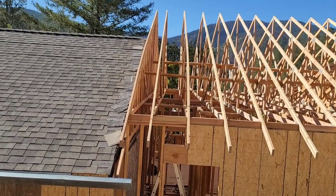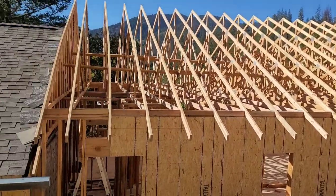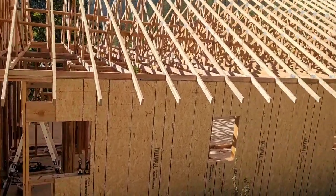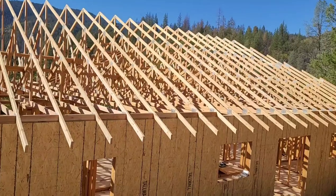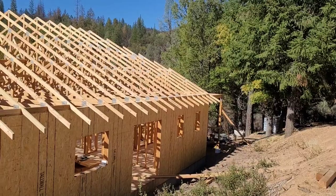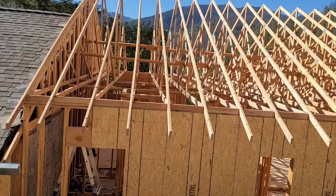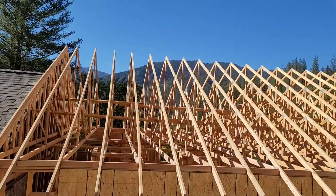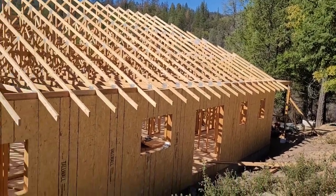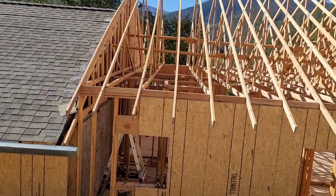They're a little out of whack right now, because when you put the sheeting on, you lay out the sheeting, so you pull the trusses into the, we mark the plywood, the roofing material, 24-inch on center. And so on the eave end, and then going up the trusses, we keep on marking them. So by the time we get to the top, everything's 24-inch on center. So basically, I think the hard work's done.